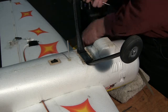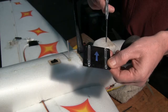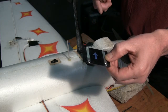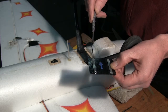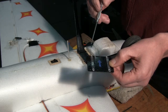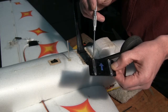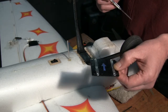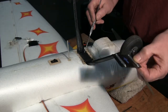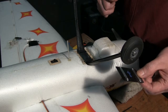We made this carbon fiber plate and you'll notice that I put two aluminum straps across the top. That's because carbon fiber is very brittle and it's possible with the twisting loads caused by this landing gear for the screws to actually rip out the sides of this carbon fiber plate. So I put these two aluminum straps across here — about 30-thousandths thick — to help protect the carbon fiber from ripping out. This plate will rest the bottom on top of the o-rings, leaving a space between the bottom of the landing gear and the bottom of this plate so that the spring portion can rise and fall in the fuselage.